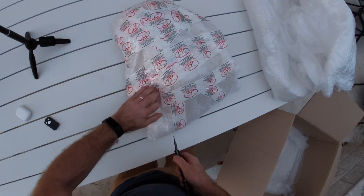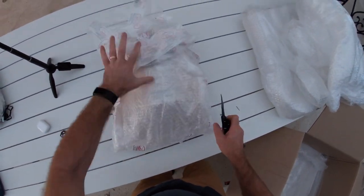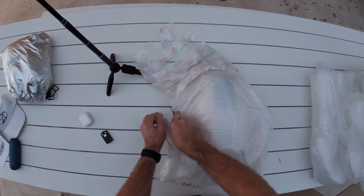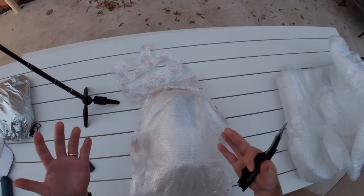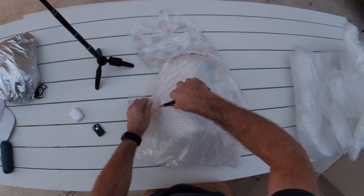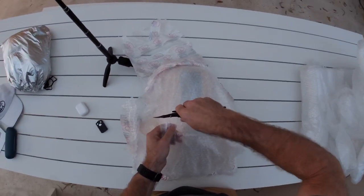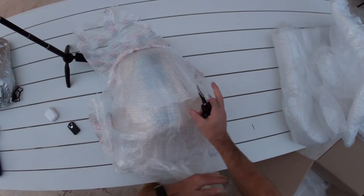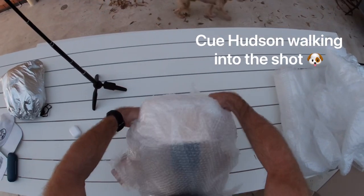So what this is going to give us is all of the engine parameters. At the moment in the rear seat, you look over the shoulders of the pilot in front and you can see the airspeed indicator and the altimeter, but you don't get to see the rotor RPM. So if you're going to be training for takeoff, you've got to rely on the student calling out the rotor RPM and paying attention to all the engine parameters. So what this does is takes all the unknown away.